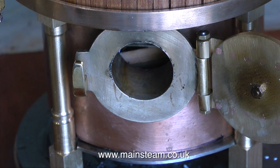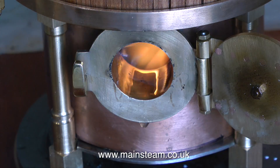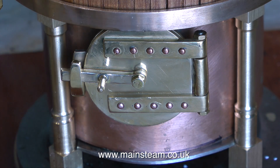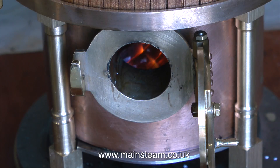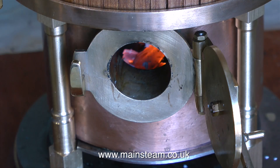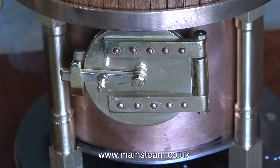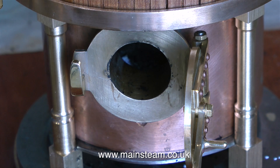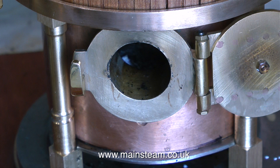Unlike the full-sized article, a boiler like this does not have any natural draft, and a horizontal boiler is even worse. I have a larger boiler plant that I use frequently — that's much easier to handle. It does have some natural draft because of its physical size, and I don't need an electric blower to light up the boiler. Oh dear, the fire seems to have gone out in this one, so I think it's time to drop what's left of this fire and have a look at it.